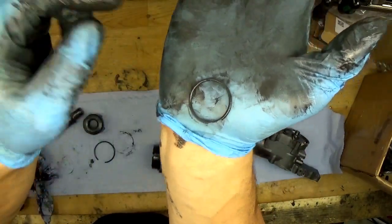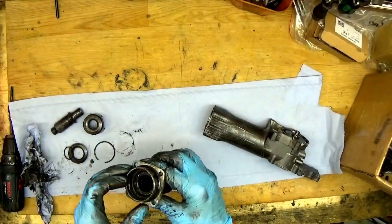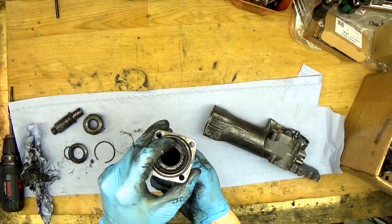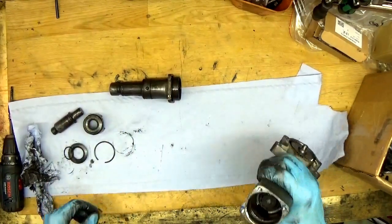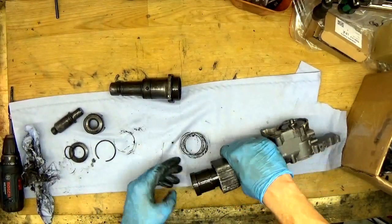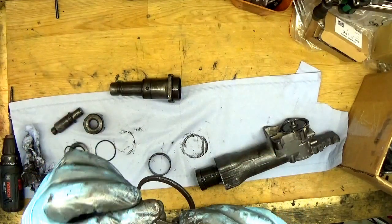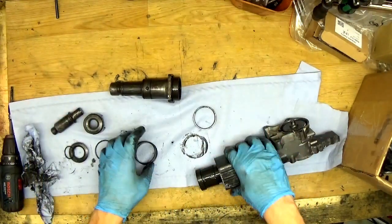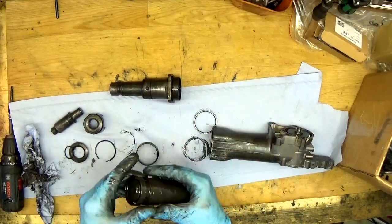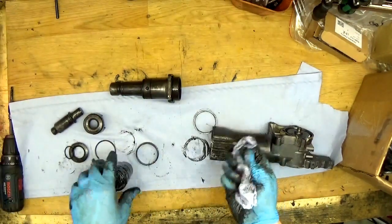It's cracked here, so we need a new O-ring, new this metal part. The tool holder itself looks good, so that's okay. Now we have the hammer here, so just hitting the housing. What can we see by hitting the housing? We can see the aluminum dust, so they can fall out from here, or of course they were not in the tool. Okay, so it's a cylinder and a hammer.